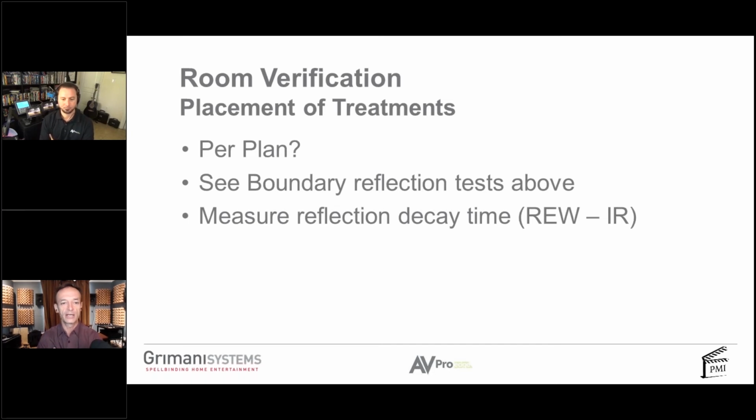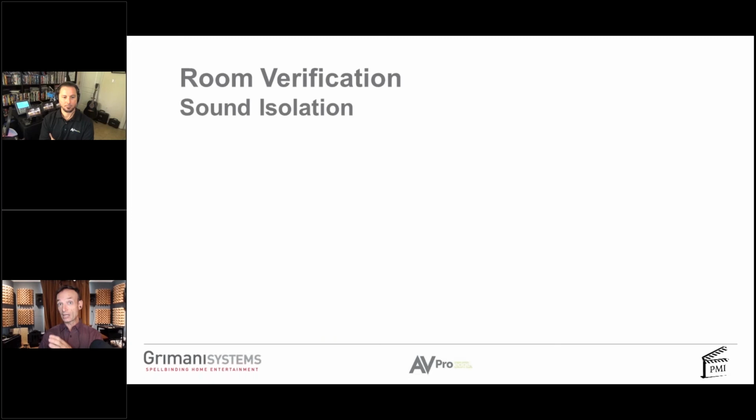Cool. So, all right, we're getting close to the end of verification. You guys are going to love this. If the room was supposed to be sound isolated, now is the time to check that the sound isolation construction was actually done correctly. And what I like to do is ask, hey, did you follow the plan? Talk to the builder. Look for pictures. Did you actually build the walls the way they're supposed to with the right isolators? Did you put giant screws through the whole wall, thinking that would rigidify it?